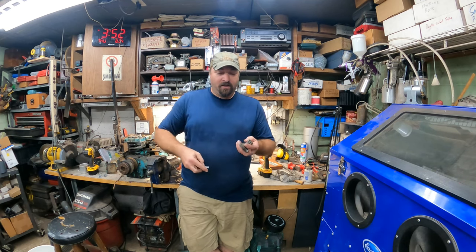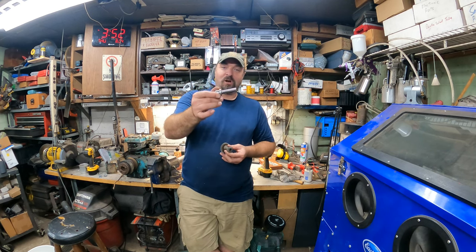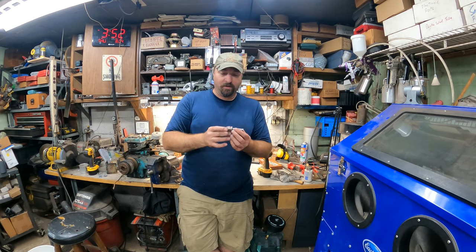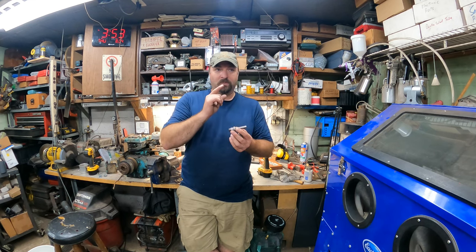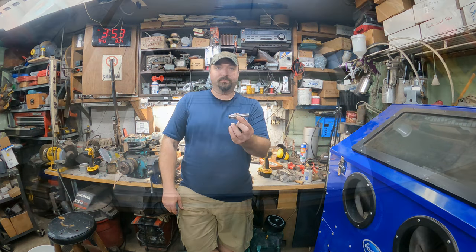But anyway, the plan today, like I said, we don't know what happened here. Instead of trying to straighten this out, we're just going to go ahead and make a new one. It's rather simple. I'm just going to use 4140, 4142, something like that. I already have it chucked in a lathe. So let me bring you a little bit closer and I'll show you what the drawing is, and then we'll get everything set up in the lathe and make this shaft.